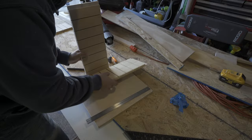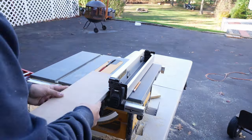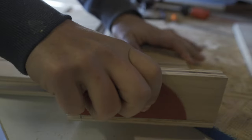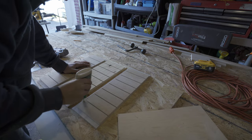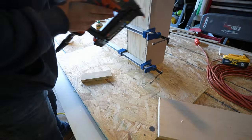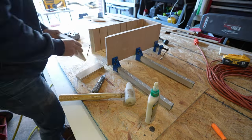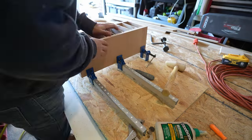I decided to try cutting some lap joints with the table saw blade and some dado grooves to hold thinner plywood dividers, building an organization system for my sandpaper. My previous method was just chucking everything into a Tupperware — always a mess and I never knew what grits I had. Now I have a bay for each grit so I'll always know what sandpaper is available. This holder was a lot more technical than the others. I learned from it that I definitely should have invested in a dado stack for the table saw or used my router, because it was time-consuming to keep bumping the blade over to make the three-quarter-inch dados and three-sixteenths dados.